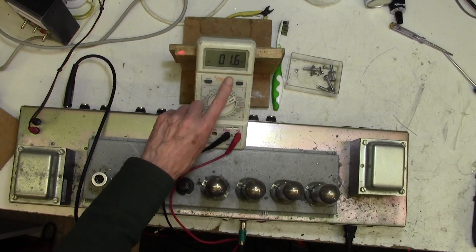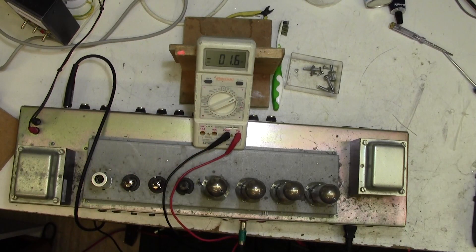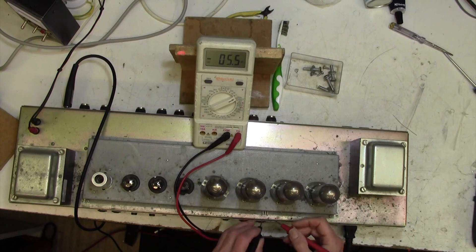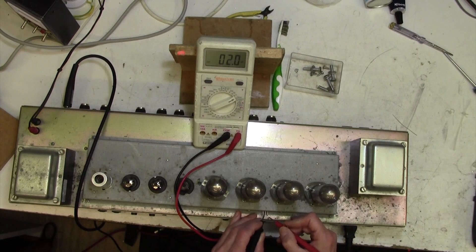You need to set your meter to millivolts because effectively we are measuring the current across a one-ohm resistor, so millivolts turns into milliamps. 50 millivolts would be 50 milliamps, 75 millivolts would be 75 milliamps and so on. You can't do any damage here — you can short circuit these, it's only a one-ohm resistor and very low voltage, so don't worry about any of that.